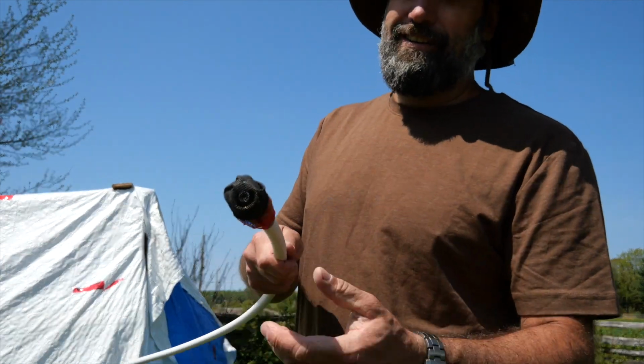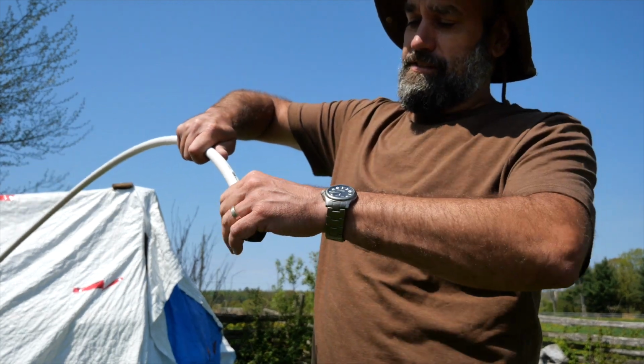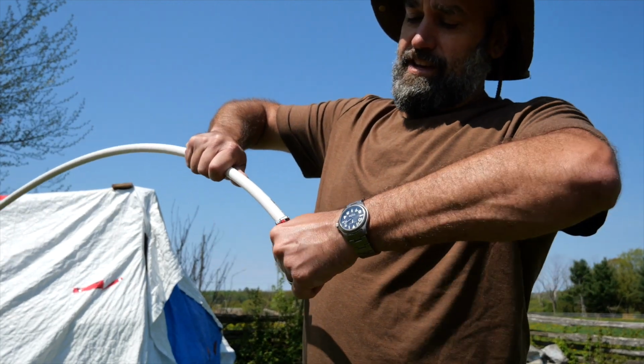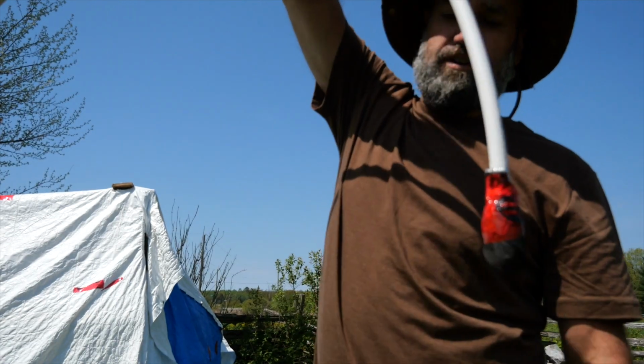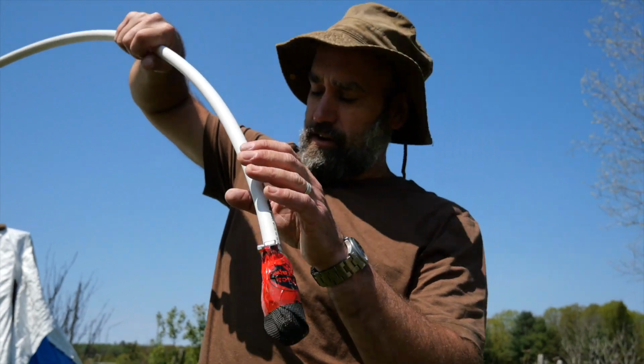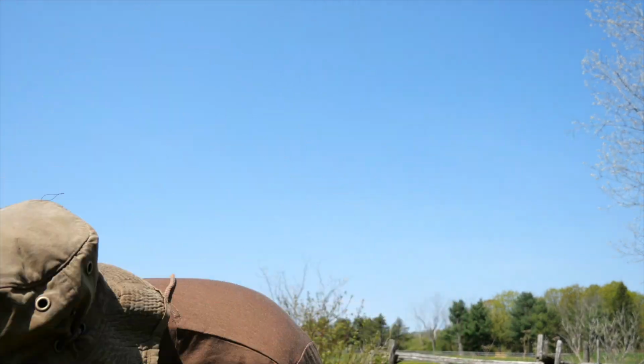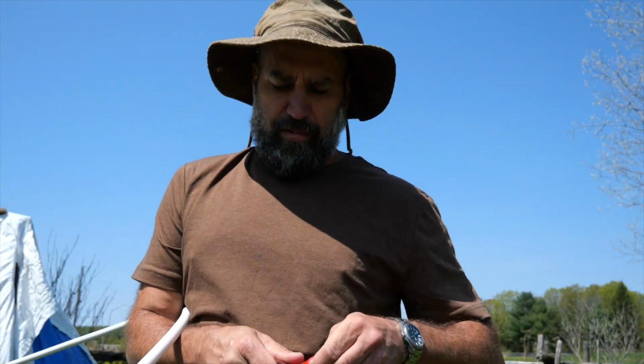Yeah. Et voila. So the idea is that this will be, and I'll tape it one more time around the edge just so it's on the PEX too and it holds it. But the idea is that this will get submerged in the water. And just in case there's particulate in the well water, that will strain it out. But there is another filter on the pump itself that will also ensure that no particulate and garbage gets into the mechanism.